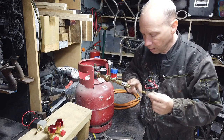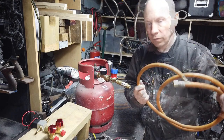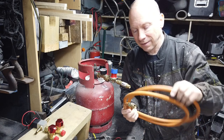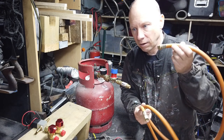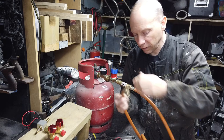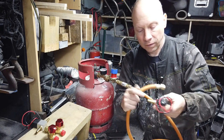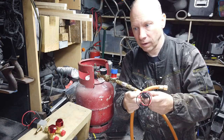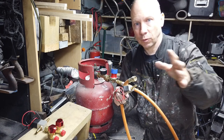Now you'll probably notice up to this point there are threads, but now there is no thread. This is why it starts getting a little bit more complicated. Using the correct hose is really, really important. This particular hose is designed for propane, and it is important that you use the right hoses. The gas itself can be corrosive and it can damage certain types of hoses. This actually screws onto the ends of the flashback arrester, which is really convenient. But on the other end there's no way to screw it onto the solenoid. So we need to cut the hose, slide it over the end, and then crimp it — either use a jubilee clip or another crimping form — to make sure we have a gas-tight seal.